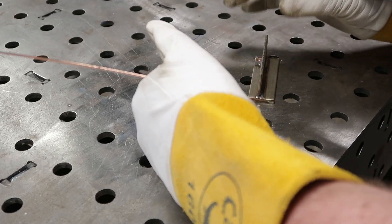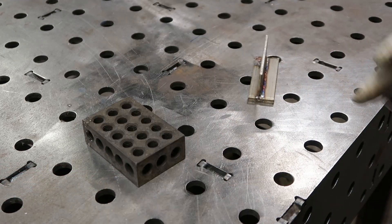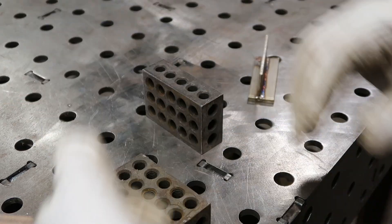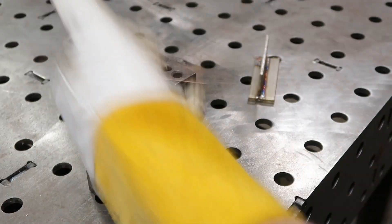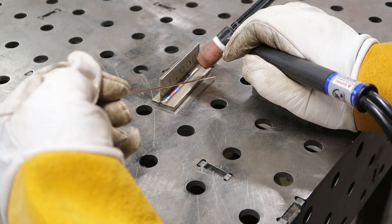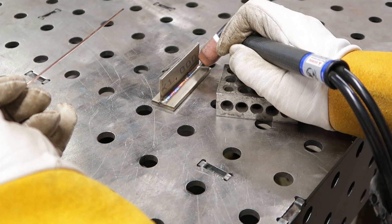One important thing while you're doing this is having a good rest and positioning your material properly. My two favorite things for rests are these one-two-three machine blocks — I can leave a link in the description, it's only about ten or twelve dollars for the pair. These are great for squaring things up and using as rests because you have three automatic different positions: one inch, two inch, and three inch. You can rest your arm on them, and the great part is they slide, so if you can't twist your wrist the entire way across the weld, you can slide it evenly and smoothly.